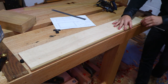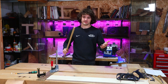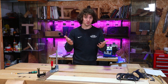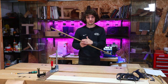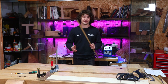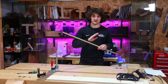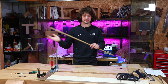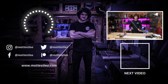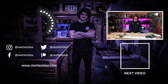And there you go — that is how you cut the profile for the plinth, or at least one of the methods. To do this with a shoulder plane or rebate plane, all you really need is a long straight piece of plywood, MDF, or wood with a long straight edge to reference off and act as a backstop. If you have a router table, just get the rebate and chamfer done now — clamping will be slightly more difficult but you won't have to faff around shaping the chamfer after gluing. You win some, you lose some. You're now ready to move on to the next lesson — click the link below, and please subscribe if you haven't already. See you in the next one.